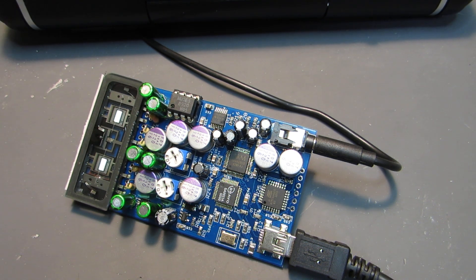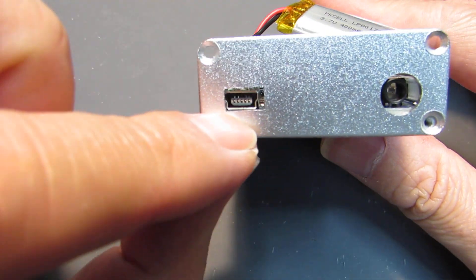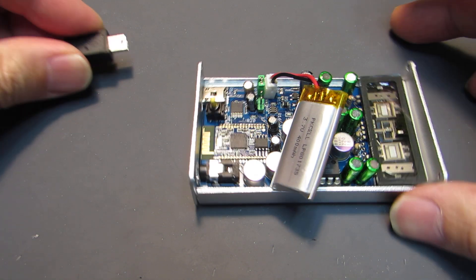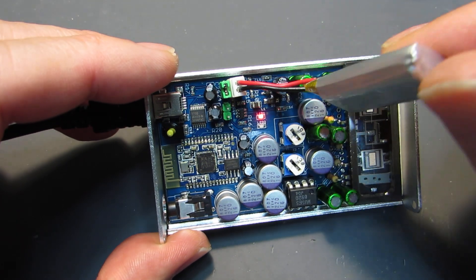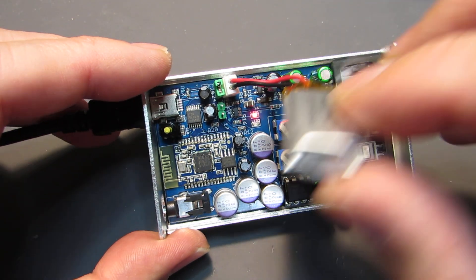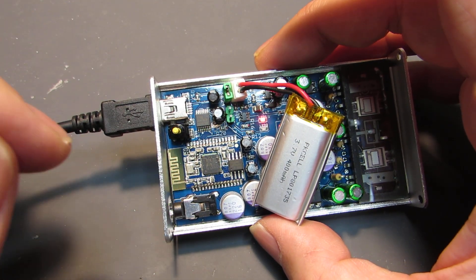Today I have another thing to present. This is the AK4493. Here is another one. It looks like a similar interface — it has a USB interface and audio output. But this USB interface is just for charging the lithium polymer battery. Indeed, it has an on-board battery charger. Here is the power source — a lithium polymer battery. It has a voltage booster, same as other AK and PCM5102 designs. But it does not have a DA converter.